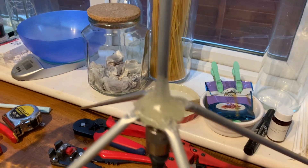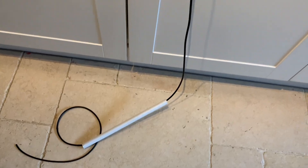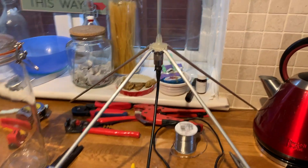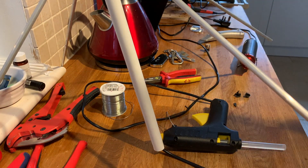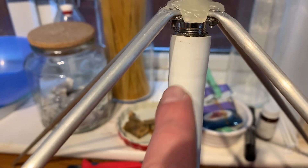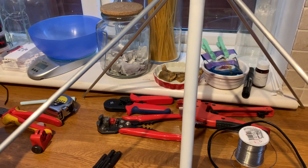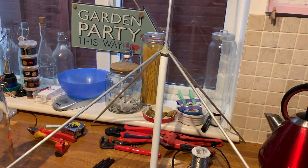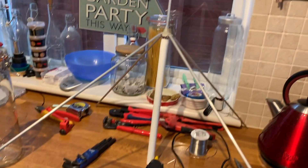Now I'm going to push that piece of PVC pipe, which we melted into shape earlier, back up underneath it. The PVC pipe is pushed up as far as I can get it. I need to put some amalgamation tape around this joint here to waterproof it, and then this will act as the pole to mount it with. Let's mount it, put an SO-239 on the end, and then SWR it and see where we're at.